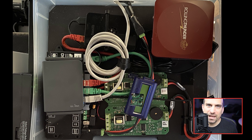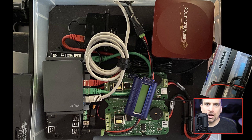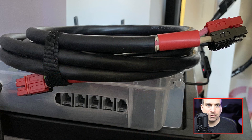There are two PSX1 circuit breakers to protect the main track and the programming track outputs. I have installed the optional buzzers that provide an audible indication when there is a short. On the right side you can see the LocoNet accessory connections. On the left are the DCC track outputs consisting of two pairs of Anderson PowerPole connectors. I have a 10-foot jumper cable to go from the control box to the layout.